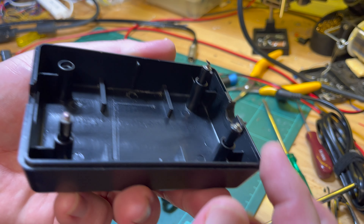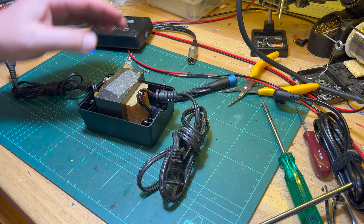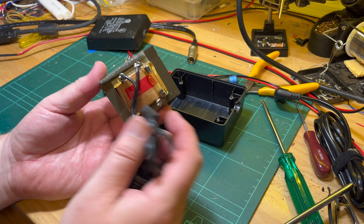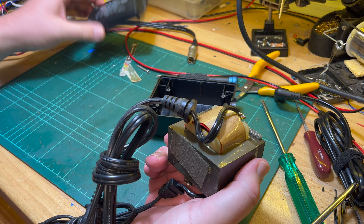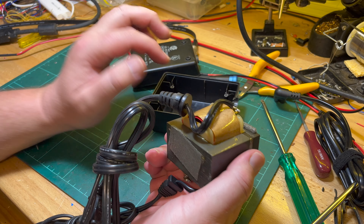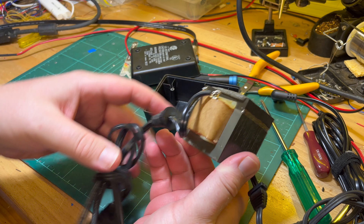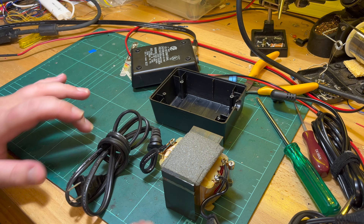As expected, it's basically just a huge transformer with a fuse on the output. I could convert this — I do have 9 volt toroids. That might fit in there, or it's just a matter of getting a 240 volt transformer with the same dimensions. I'm hot and sweaty. I do have two 9 volt toroids — that's 60 volt-amp. I'm not sure what this one is — 2.78 amps, so that's about 5.6 amps by 9. This other one is the bigger one.